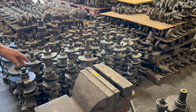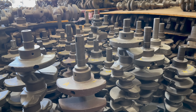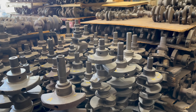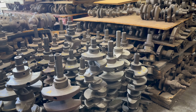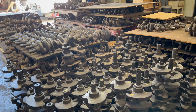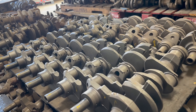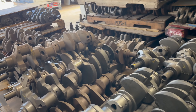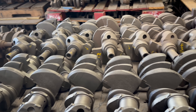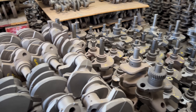The long nose crankshaft like this is usually a 390 Ford — or a 360 Ford. That makes me think if they're the same crank, it's probably the bore that's different on those engines — or the stroke could be different. That family of motor has a long snout on the front. You can see them here.